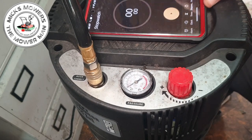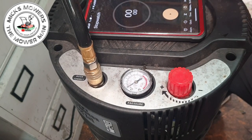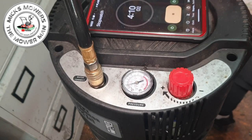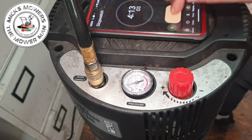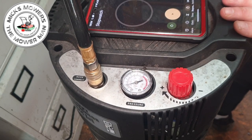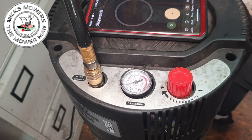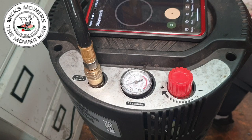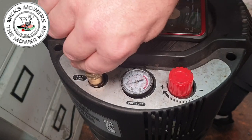Just to make it fair, I'm going to put my phone here and set the stopwatch on. We'll go 4 minutes. Okay, so as you can see - let me just pause that - 4 minutes 13 seconds, and it's still only 1.5 bar. At around about 1 minute 20, that's when it reaches 1.5 bar, and it's been another couple of minutes over the top of that and it's still not going above that. So I don't think it's actually a regulator problem. I think there's something else going on. Maybe it's got a leak, but it's not leaking from anywhere inside the unit at all. I have checked all my seals and they're all good.